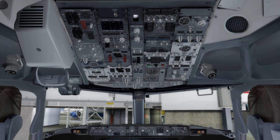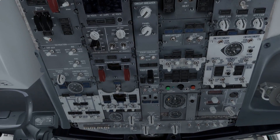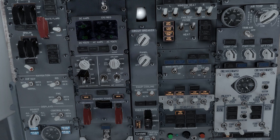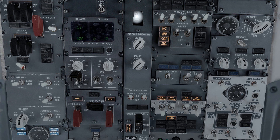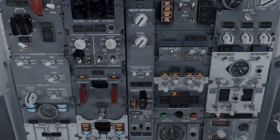The first thing we need to do is the power up and safety inspection. This is done by the captain. First off we need to establish DC power for the aircraft. This is the battery switch — make sure it's set to BAT and then select it to on. You see some lights lit up there, meaning 28 volts of DC power is now coming into the aircraft, which means we can do some checks and then establish AC power.